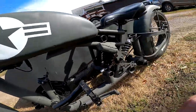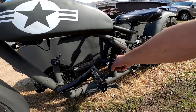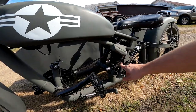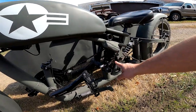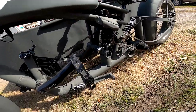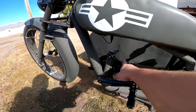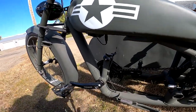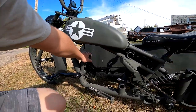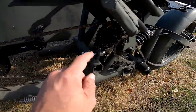And then right here, we have a regular mountain bike 7-speed hub. It was a cheap steel one. I welded the caps to the center since there's no spokes holding everything in line anymore, and welded an extra gear onto this cap for it, so that way it can transfer the power to the jack shaft. And then up front, we've got our normal mountain bike 3-speed front end. Put Shimano derailleurs on it, front and rear. So the rear one, sorry, is over here.